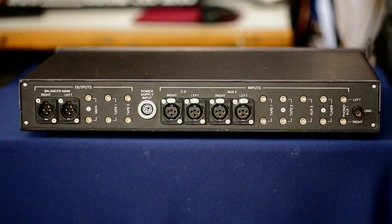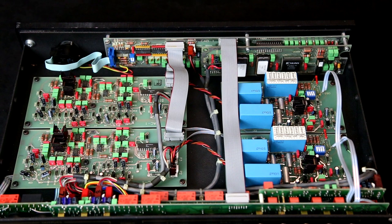This is what the inside of the Mark Levinson Number 28 looks like with the cover removed, and it is without a doubt the most complicated preamp I have ever run across. This area is for the phono section. These DIP switches are for different loading configurations, and there are DIP switches here that set the gain for the moving magnet or moving coil phono cartridge you may have. This DIP switch sets the gain of the line stage of the preamp.